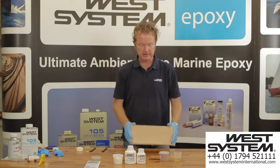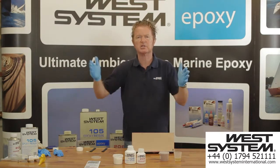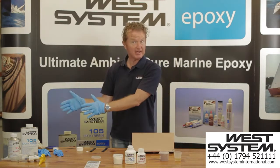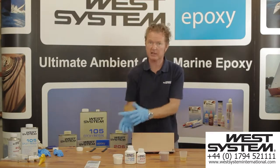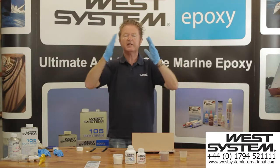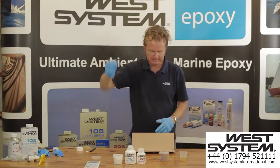surrounding plywood panels. Now, to make this thickened mix we want a really robust thickness. We target viscosities within the West System technical information as syrup, ketchup, mayonnaise and peanut butter. That's very easy to understand. Syrup is just the resin and hardener mix. Ketchup is a little bit more filler added, mayonnaise a little bit more still, and peanut butter is really thick and capable of standing upright without slumping. In fact, it will stay on your mixing stick upside down, and that's how you test for the correct viscosity.